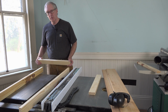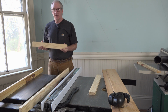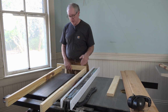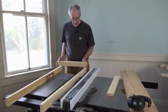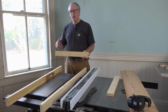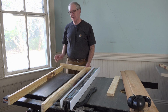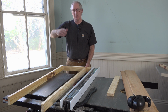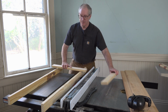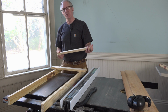When we do woodwork, we always cut our boards a little long because we know we're going to do some trimming. You can always take it off, but you can't put it back on again. I'll make 2 miter cuts here and here, and then I'll make a miter cut on here, and then figure out how long this one needs to be, and miter cut it at the correct length so when it goes together, that it's perfect. Now, when I get to the other side though, these boards are extra long, and so I'm going to have to miter cut them to the correct length, and then miter cut both of these to the correct length. If we do everything correctly, it should all fit perfect.